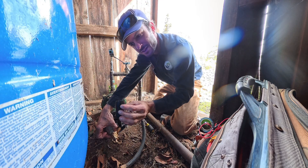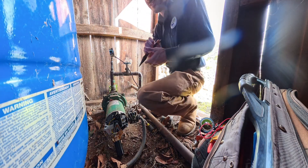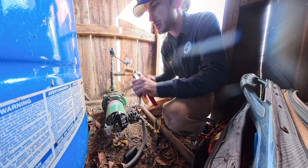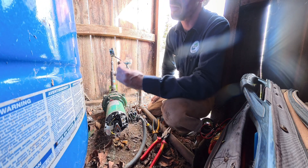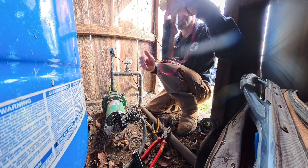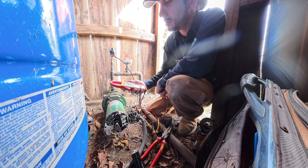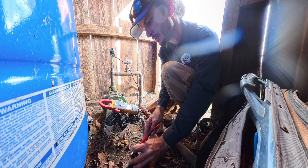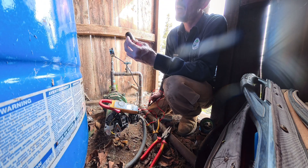You can see the lid just came clear off — yep, there's everything. You can see down in there, doesn't look too good either. It's not supposed to do that. I was going to test it but I think we can say it's beyond its life. For fun, let's just see what the microfarads are. It says it should be 161 to 193 microfarads. Yeah, too low — okay, so we've got to get a replacement.